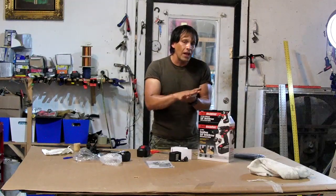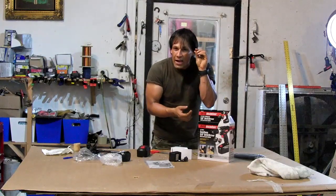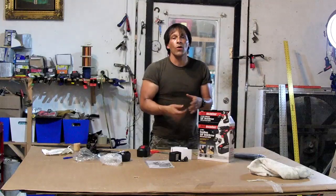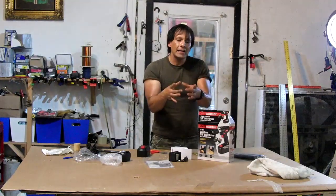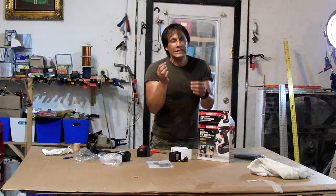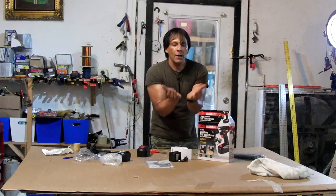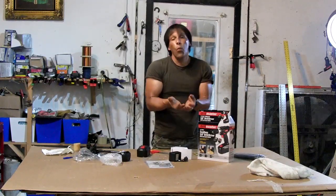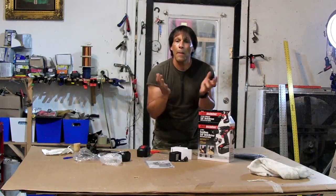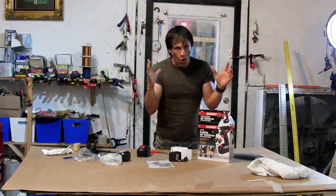So adding multiple lenses, one on top of the other, simply shortens the focal length, and it does tighten the spot a little bit, but the light filtering that you get takes away from your power. In the previous video, I showed you how adding a secondary lens to a Fresnel lens short of the focal point, while it does tighten the spot a little bit, you lose too much power with the light filtering. Adding a parabolic mirror to catch the light and bounce it up won't work either, because it'll damage an acrylic parabolic mirror and it'll also mess up a metal mirror. The heat pattern is just too much for you. You're better off going with the Fresnel lens all by itself.